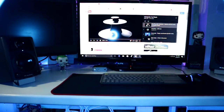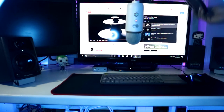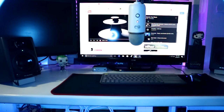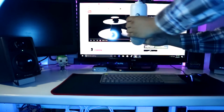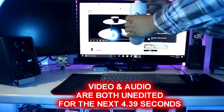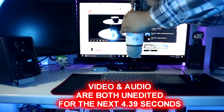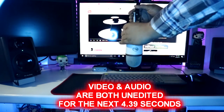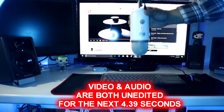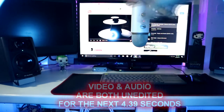So guys, it's time to test. Now what I'm going to do is I've got YouTube up with some high quality audio. I'm going to try and position my Blue Yeti microphone at around head level so my ears will be the microphone, if you will. The speakers are going to go at around 25%. I'm going to move the pop filter away. I'm going to have the microphone set on omnidirectional instead of just cardioid, which is what I usually record with on my voiceovers like this.